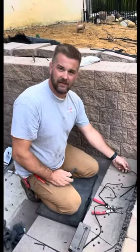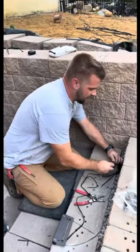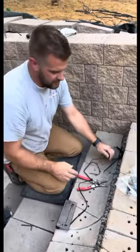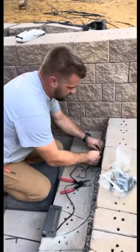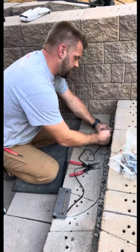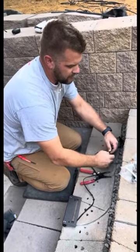So after you connect your Ace connectors, you take your two heat shrink and slide them on. Now obviously it's very important to do this before you connect the other wire. So you just leave it like that. Now connect the light to one of these wires and you just put it in one of these terminals. Because it's low voltage, it doesn't matter. Take your Allen key and tighten it down. Now take the other wire, connect it to the other wire, and repeat the process.